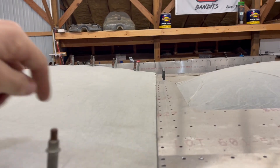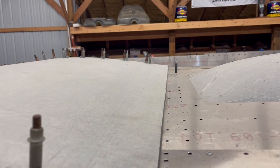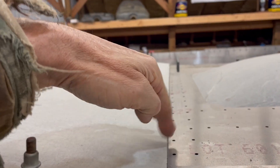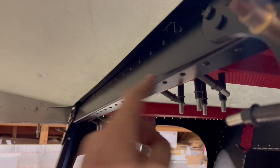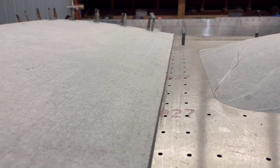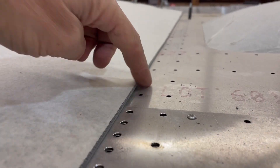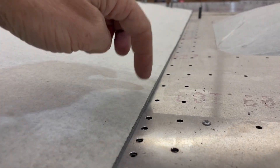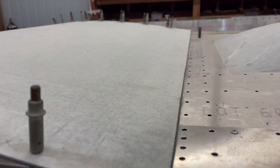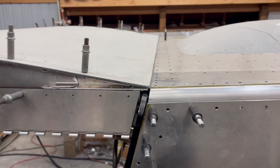All I really need on the top window is drilling this back line of fasteners there along the back of it — it goes through the top skin, just forward of this big channel. I'm kind of hesitant to do that at the moment. I'm going to study on exactly how I want to approach that. There's supposed to be a piece of cork that goes underneath it, then a hole through the glass, through the cork, and through the skin there. I want to seal this thing good.